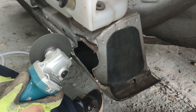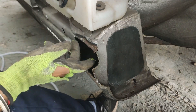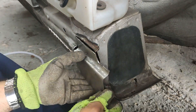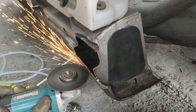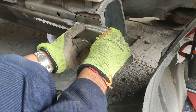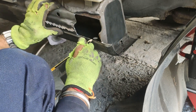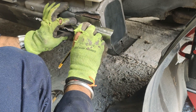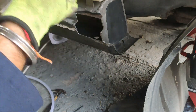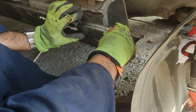Now I'm just gonna go around and make some small cuts so all the faces of the repair patch can meet the sill nice and straight. I'm aiming for about a half mil gap the whole way around consistently in order to get my weld nice and strong with good penetration, hopefully without the blowing through that we saw in the previous episode. Here I'm using a thin straight bit of steel to mark out where to cut the lower edge, then nipping off tiny little edges the whole way around on both the patch and the sill just to get it sitting just right.